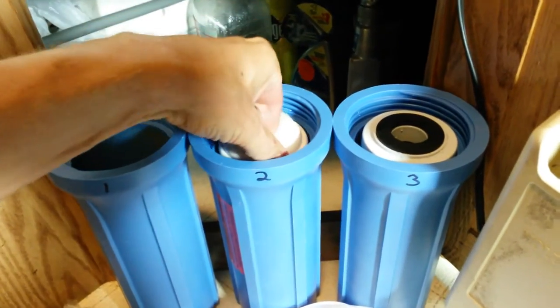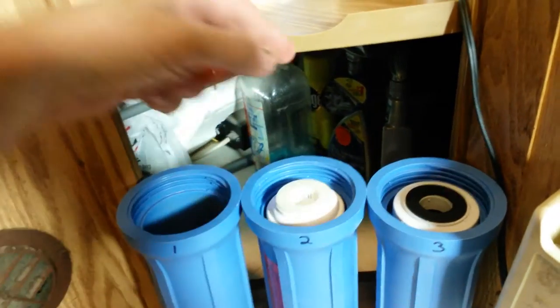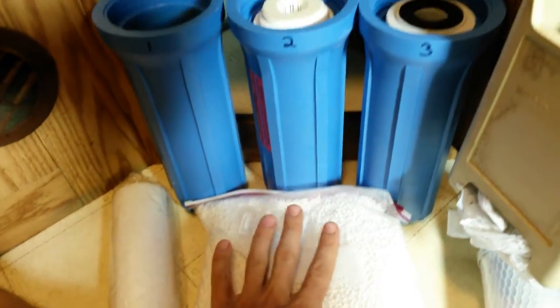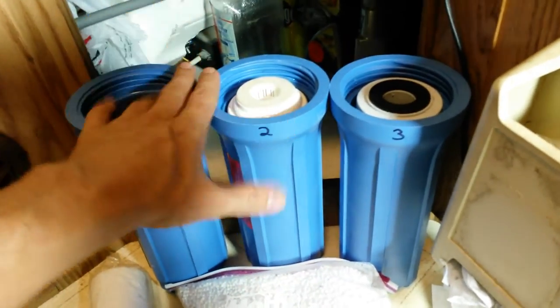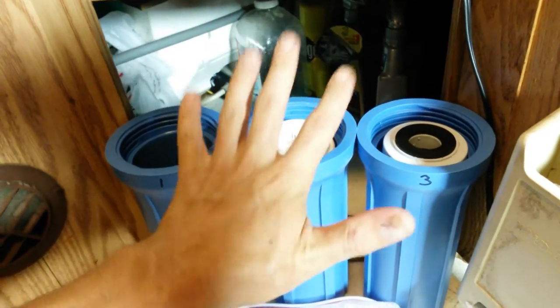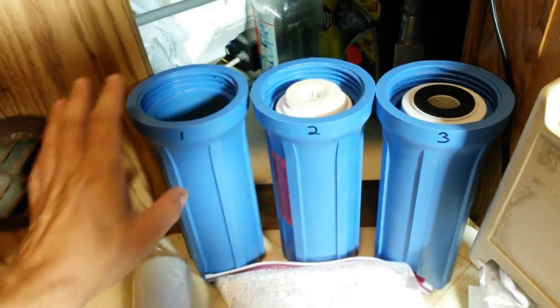I like to use three-stage canister filters — they use 10-inch canister filters — but they also make a really cool new kind where you just press a button and plug the filter cartridges up into the base. I'll put links to both kinds in the description below at the best possible price. The only reason to go with the big canister style is if you want arsenic and fluoride filtration and silver ion filtration. Otherwise, go with the new kind — they're so easy. I installed one for my mom and it takes less than a minute to replace all four cartridges, even the RO cartridge just snaps right in, no mess, no worry.